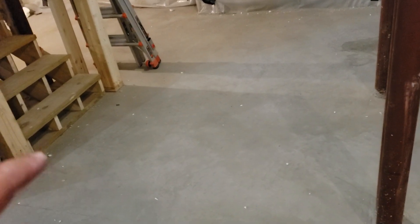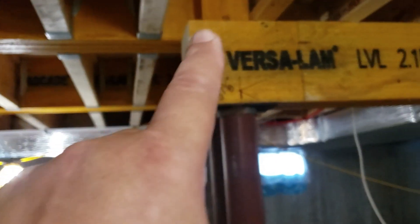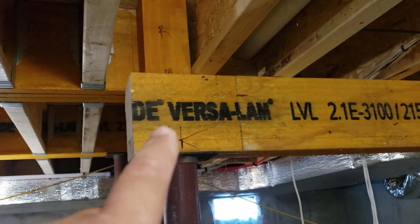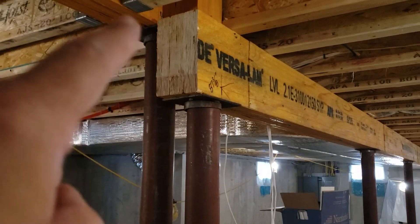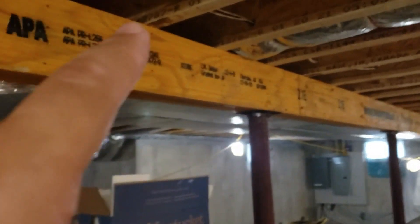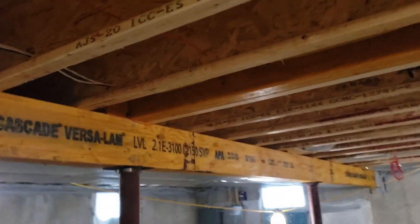The transition happens down at the bottom of the stairs, so this allows you to come down and have a nice resting space to turn and come into the clean basement, with the dirty basement on the other side. With that header it comes down and we do the reverse — we're actually picking up a column carrying some framing on the second floor. I do this quite often: two lolly columns parked next to each other, one carrying each beam. This one drops down again for the same reason — dirty basement on one side, clean basement on the other.